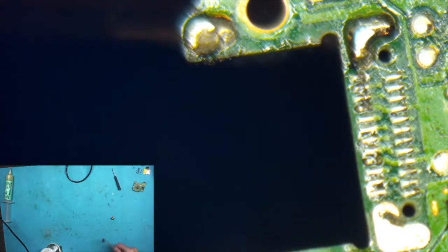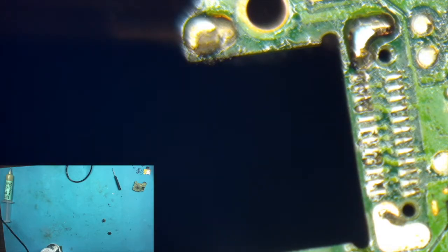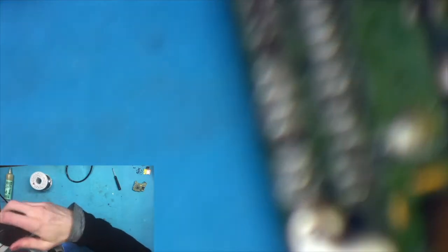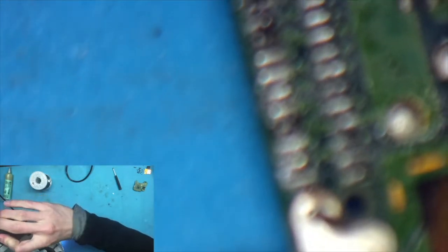Whenever you lay down the low melt stuff, you don't have to completely remove the old solder. You can just blend it in, and with some chemical mixing that's going on, it makes the melting point of it much lower, so it's a lot easier to get off, especially for big ground planes like what the USB-C port has up near those pins. You see those two big ones up and down, on the very bottom of that row of pins, the two columns of pins, one at the bottom, one at the top. It's especially important to put that low melt solder in there.